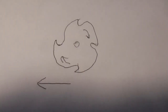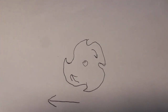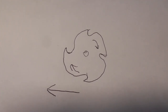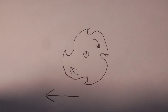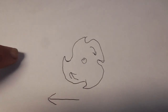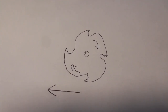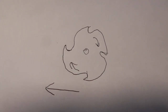Here I've drawn a rough diagram of my saw blade showing the direction of rotation — and the bottom arrow is the direction that you push the blade, meaning you're pushing against the rotation. If you go the other way you're doing a climbing cut, and the problem with that is it's trying to pull the saw into the work piece all the time. I don't like climbing cuts — the saw tries to overpower you — so I always like to cut in the opposite direction to the rotation of the blade.